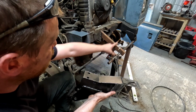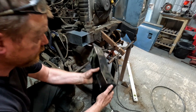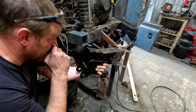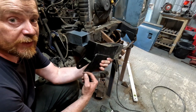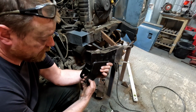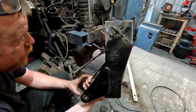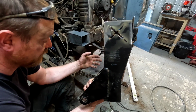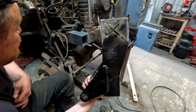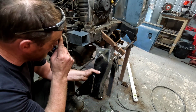That, obviously, is fastened up there, secure on the floor. That hasn't moved anywhere, so when I put that up, it lines up perfect. The main thing to get lined up, the most important thing, is that hole, because that then sort of dictates where your suspension sits. So that hole has to go in. The aftermarket parts, same as always, are not always a perfect replica of the original. Not that you could tell with the state of the original on this. But all you can do is get it as near as you possibly can so it looks right.